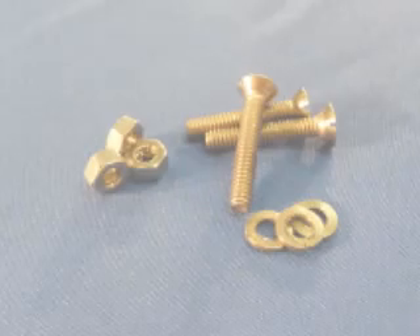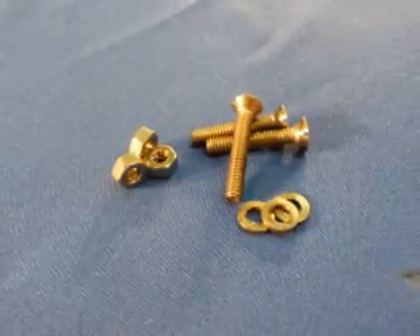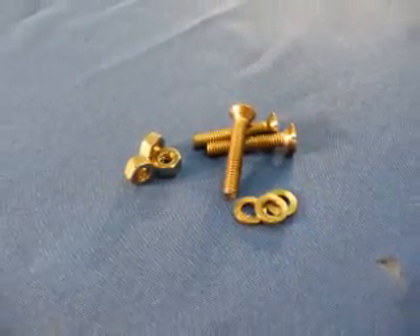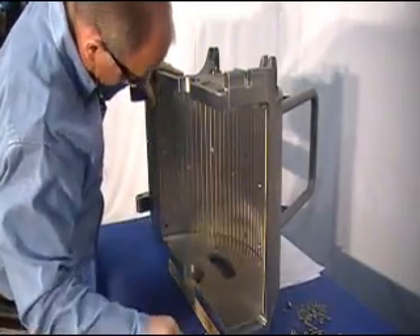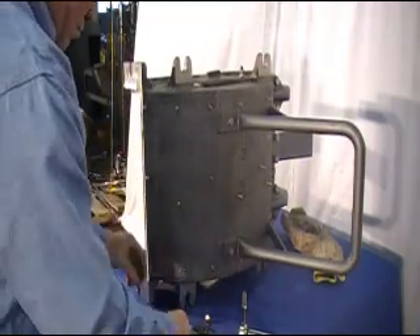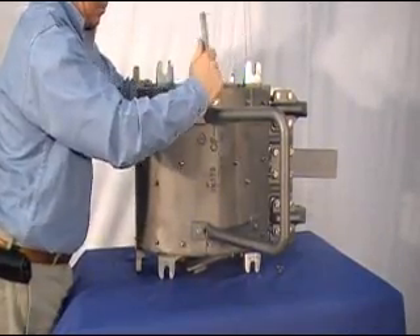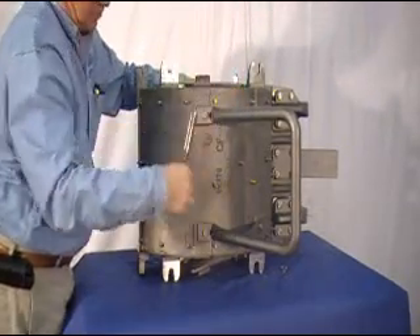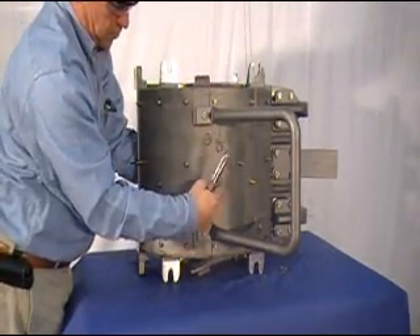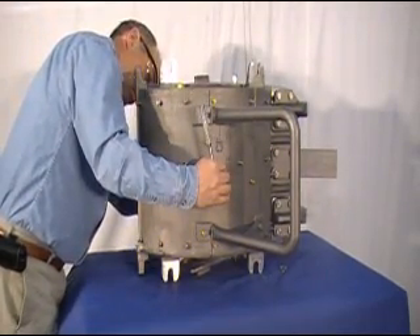25 inch-and-a-quarter long quarter-20 flat head machine bolts are used to secure the liner in place. All of the bolts should be installed from the liner side through the cover. Quarter-20 hex nuts should be loosely threaded onto the securing bolts. Beginning at the center of the liner, the nuts should be tightened along the width of the cover. Then working toward the infeed side of the cover, the remaining nuts should be tightened in rows until all the nuts have been tightened to the proper torque.